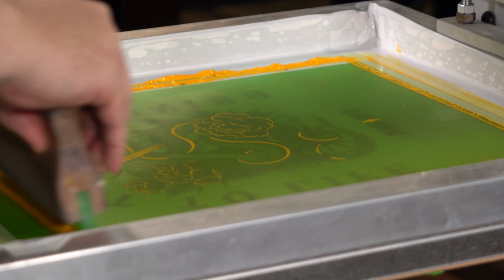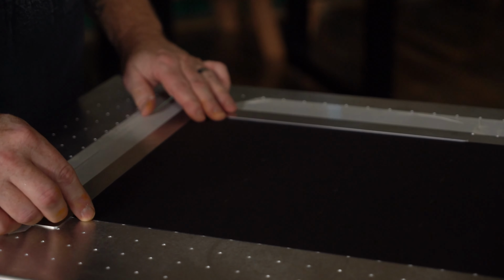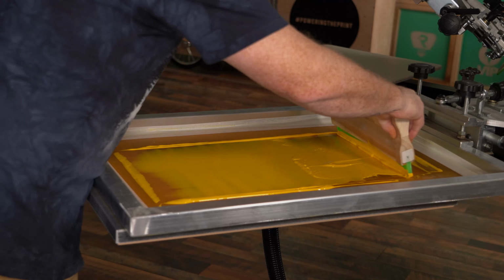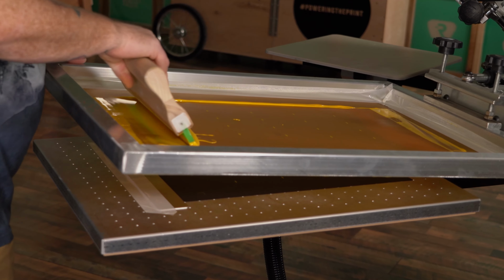For both normal platens and vacuum platens, use a jig so the paper lays down in the same spot each time you put down a new sheet of paper. Use something strong enough to lock in that paper placement, but thin enough so it doesn't affect your print stroke.